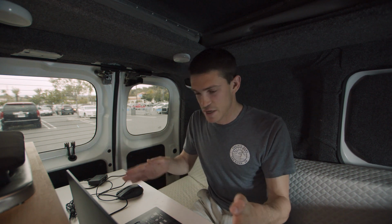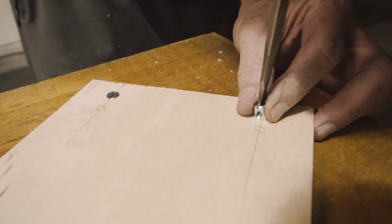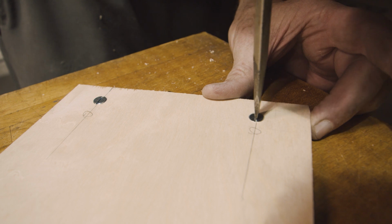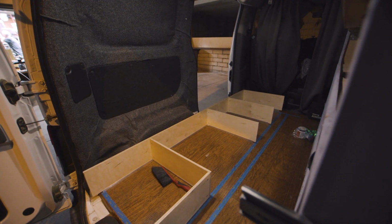You wouldn't be able to do that with wood screws, right? If you took two pieces of plywood, half-inch, and then stuck a couple wood screws in on each side, that joint's gonna fall apart pretty quickly. It's not gonna really handle much, and if you put any weight on it, it's just gonna collapse. But with cross dowels, you're taking a machine screw and screwing it in from one end, and you're putting a cross dowel in the other end, and then you connect them all together, and that creates an incredibly strong joint. I mean, to the point where you could put it down in like a triangle after you created this joint with the two pieces of plywood and step on it, and it's not gonna break. It's gonna be completely strong and handle everything that you throw at it.